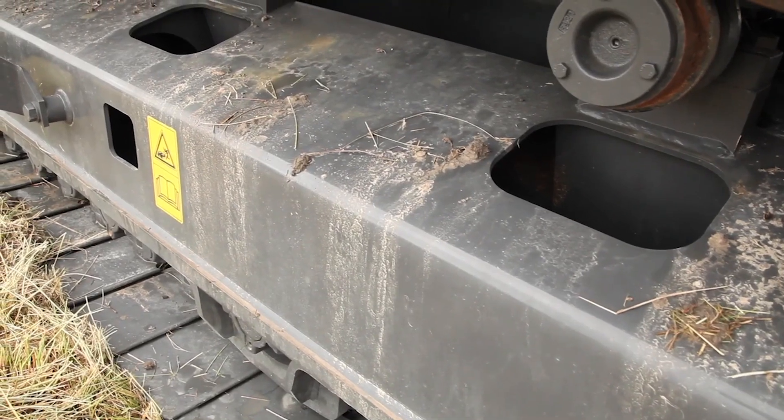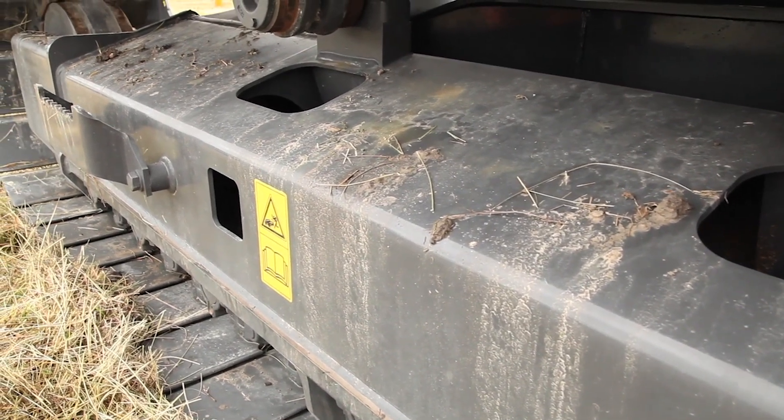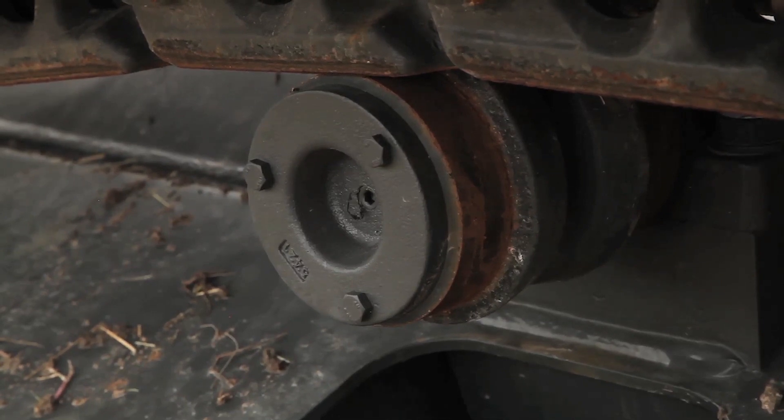If you don't keep your undercarriage clean, you're going to have buildup of material here, and that material is going to carry through on the underside, across the links, and actually wear those components like your idler, your links, or your sprocket. It's going to create more wear, which means you're going to have a costly repair much sooner down the road.